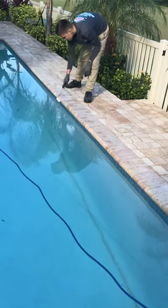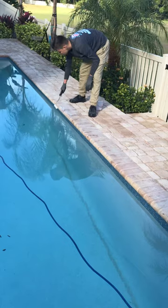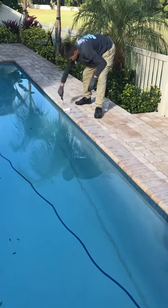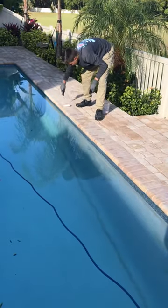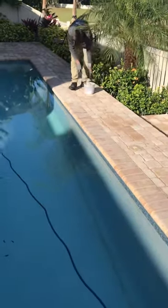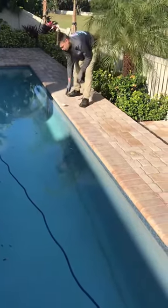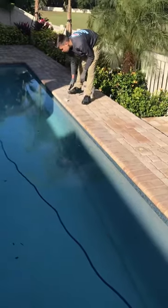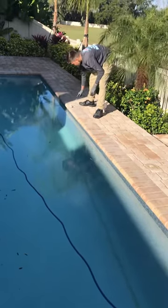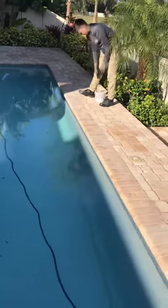The hardest part is just getting those edges. If you don't get this right, the drip lines will really show. You can do an awesome job sealing and cleaning through the whole process, but if you leave drip marks or places that didn't get rolled on, the homeowner is going to call and complain. Usually if we get a callback, it's because we didn't get the coping right, or it's something to do with sand levels. That's why we hand paint this — to limit any sealer getting into the pool and to give a much more thorough job.